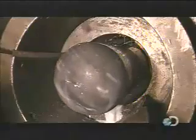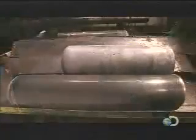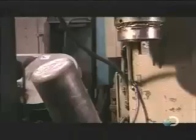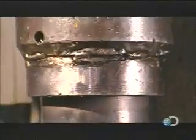That liquid is a coolant to prevent overheating. The cylinder goes through as many as 3 presses, each one stretching it another 60%. This press forms the closed bottom end into a concave shape. That reinforces the base, helping the cylinder withstand up to 1,000 times more pressure than a can of cooking spray.